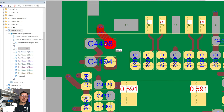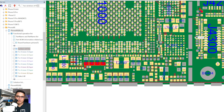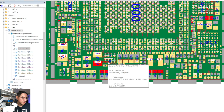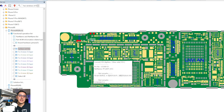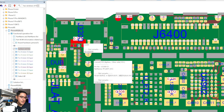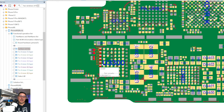Think of it like the plumbing scenario again: the main water line from outside has to go through all these different paths to get to a master bathroom leak. These are like little bridges of different lines to get to that shorted cap. Because the cap is shorted it's pulling current through all those points — the chip, the resistor, and the back of the board — which generates heat at each bottleneck along the way.